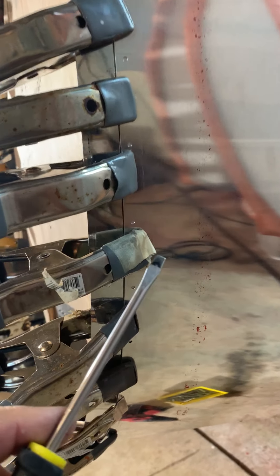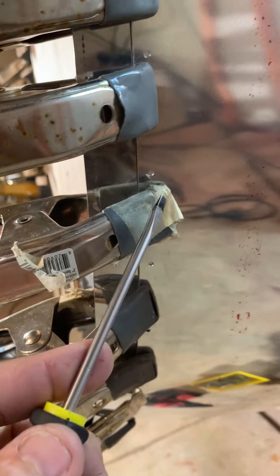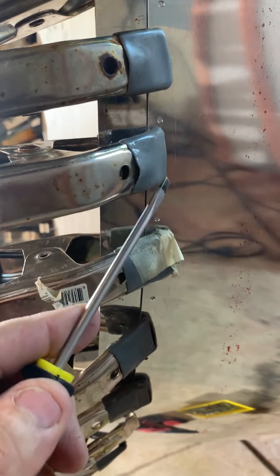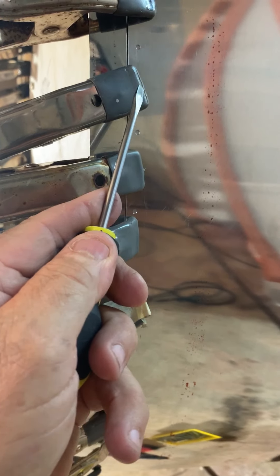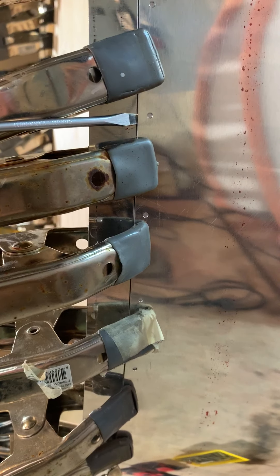I'll show you as I go. What you want to be careful of is you don't want any buckling between these two pieces. Later when you're looking at your boot cowl, you don't want to see a buckle. The importance of that is using a lot of clamps. After I put one rivet in, when I'm going up, I take the clamp off, push it down really good here and here, then reclamp it, making sure it's absolutely tight between the two rivets. I'll put that rivet in, then take the next two clamps loose, push it down with my hand, clamp it while it's down, making sure it's all nice and flush and smooth, and keep working all the way around to the top.